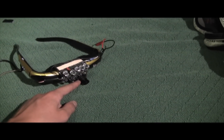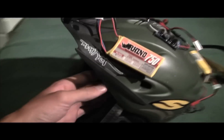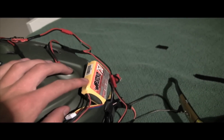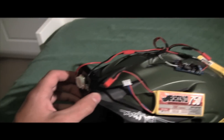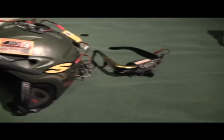I'm seeing the video the camera sends into these goggles, and I wear the goggles under this old ski helmet. I run the lights and the camera off an 11 volt battery. It works very well — it allows me to see in pitch black. I've also got a 10 watt LED connected to an LED driver that runs off the same battery, just in case I need a lot of normal light so I can see without the goggles.